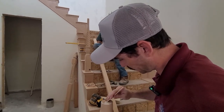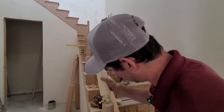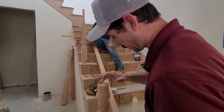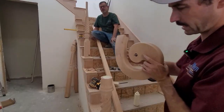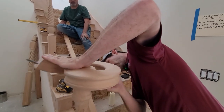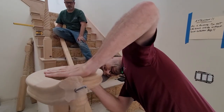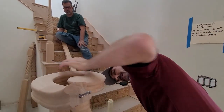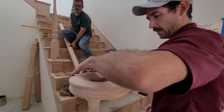So I'm going to break this piece of wood off inside there. And that's going to create some pressure in there as we spin this on because it's not very tight right now. So we're going to stick some glue on the top. That's probably too much glue. Be careful it squeezes out everywhere. So we're going to keep it kind of in the center here. And we've got this dowel screw. I'm going to stick that in the hole. And because we added that little piece on there, it's going to get a little tighter than it was as we screw that down on top of there. There we go. We're going to go one more turn. I'm going to pull that all the way around to here. And we got some glue squeezing out, so we know we have good contact.